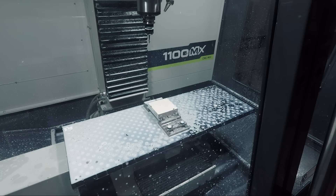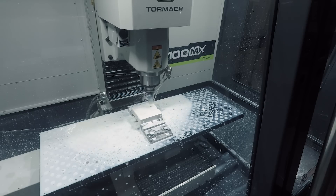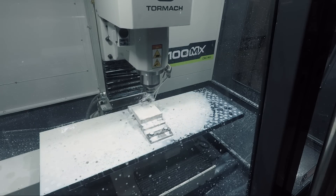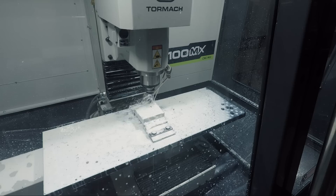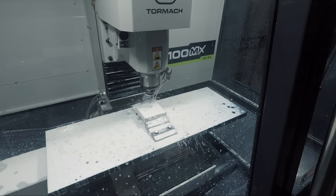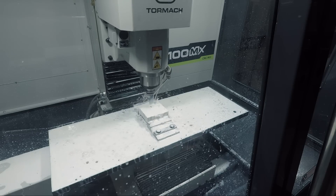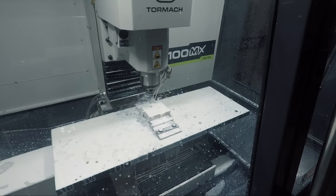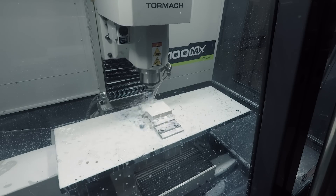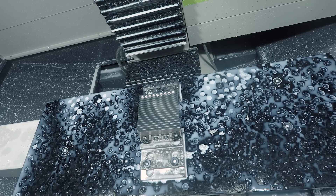Back to the tapping. Since the machine always knows rotationally where the spindle is, it can safely feed rigidly held taps in and out of holes at the proper thread pitch. I was happy to see that even at this low RPM and in the high belt range, there was no noticeable bogging down — it didn't seem to struggle at all, just chewed right through it. This new feature changes everything in terms of being able to tap parts right on the machine, and even more so in my opinion, being able to do quick in-place fixtures with threaded holes for workholding.